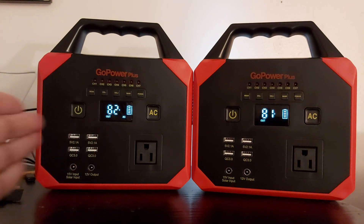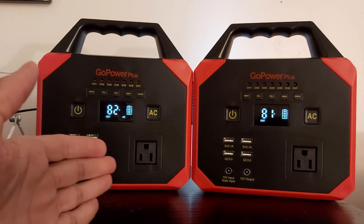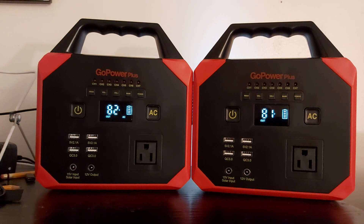I'm going to build the Ultra. I thought I was going to do 512Wh, but since this one is 512, I'm going to go to 1024. I have another battery — I can go up to 768. I would have to buy another battery to make it 1,000 watts. I need to get panels to match that power. Two 100-watt panels, or a 120 and another 60. I think the max is 260 watts of panels with this controller, unless I beef it up to 24 volts and go up to 560 watts.